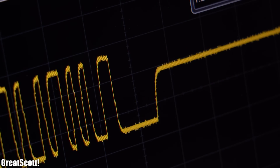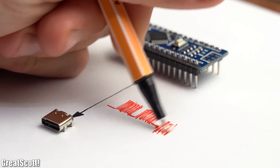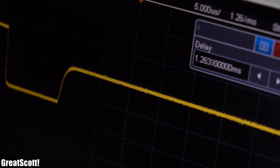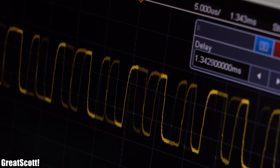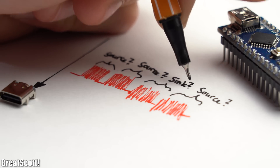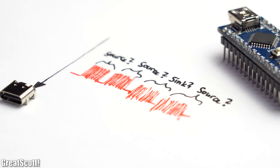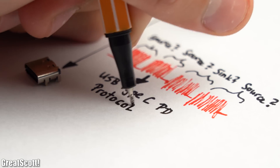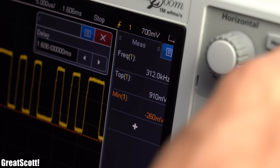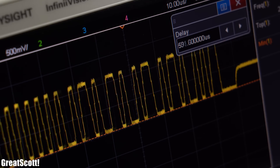Like expected, we got a data communication between the sink and the source on one of the CC lines. So my first idea was to simply copy this data transmission and let another microcontroller send it out in order to select a certain voltage. But there were two rather big problems with this idea. The first one is that with such data communication on the oscilloscope we cannot know for sure which part is sent by the source and which by the sink, and thus we cannot use it all for the sink message. The second problem was even more important: the measured logic levels are not standard voltage values and the used protocol seems overall a bit unique.